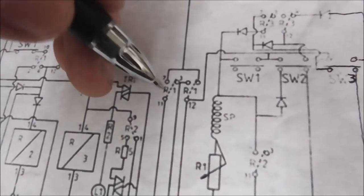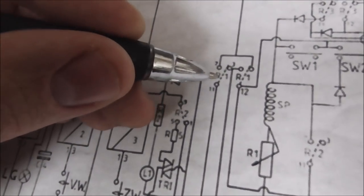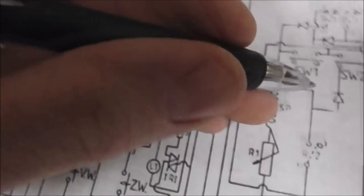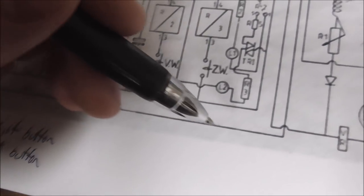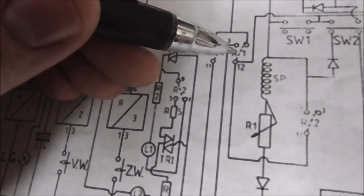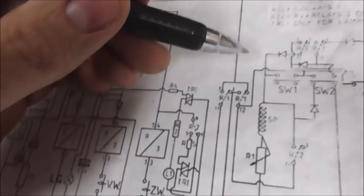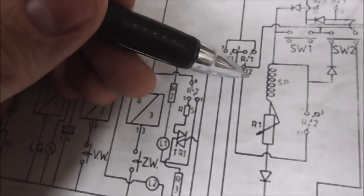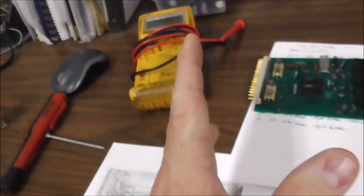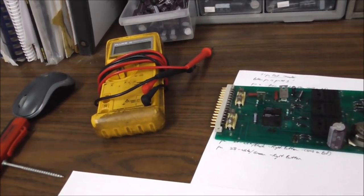Okay. And then you put a coin in, and it turns on relay 1, which is what ours isn't doing. Well, that would make this go this way, and this go this way, right? Which reverses the power. So now, the ground that's coming up, instead of going down here, it would go over here. And the 48, instead of going down here, it would go down here, right? So it just reverses the voltage. So now all of the motors are going to move the other way whenever they get power.